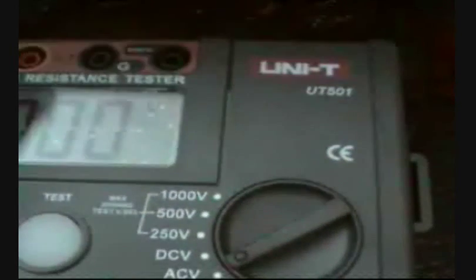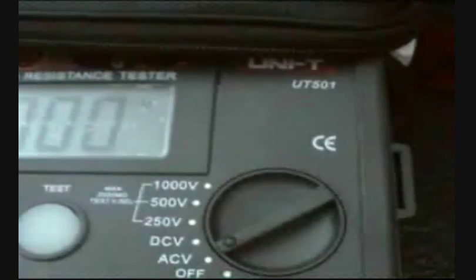This series has the 501 and the 502. The 502 is going to have 10% more output, and it's going to have 3% plus 1 for 2500 volts, which this one doesn't have. This one is going to have 3%, plus 5 for 1000 volts, and a maximum of 2000.